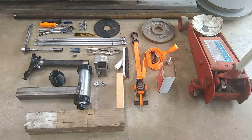Hey guys, so I've been on a mission for the last three weeks trying to figure out a way to manually change the tires on my wife's 2011 Hyundai Genesis Coupe. I have some experience manually changing tires, but those tires are 185/60/15s — very tall sidewall, narrow — so they don't require much effort with a couple of tire spoons. This car has an 18-inch wheel with a 225/45/18 tire, which is a very rigid sidewall and requires more effort. Let me go over the parts I used to get the tire off, then I'll show you the setup.